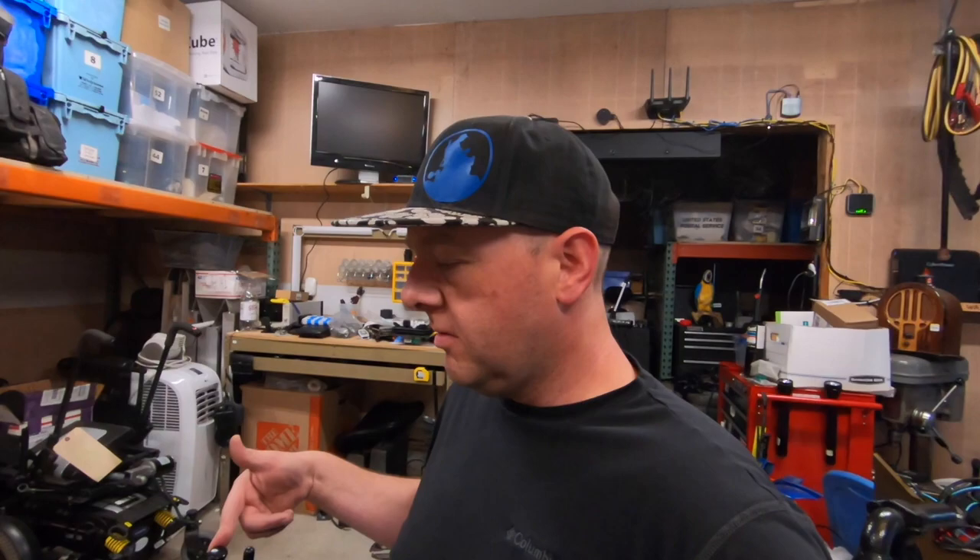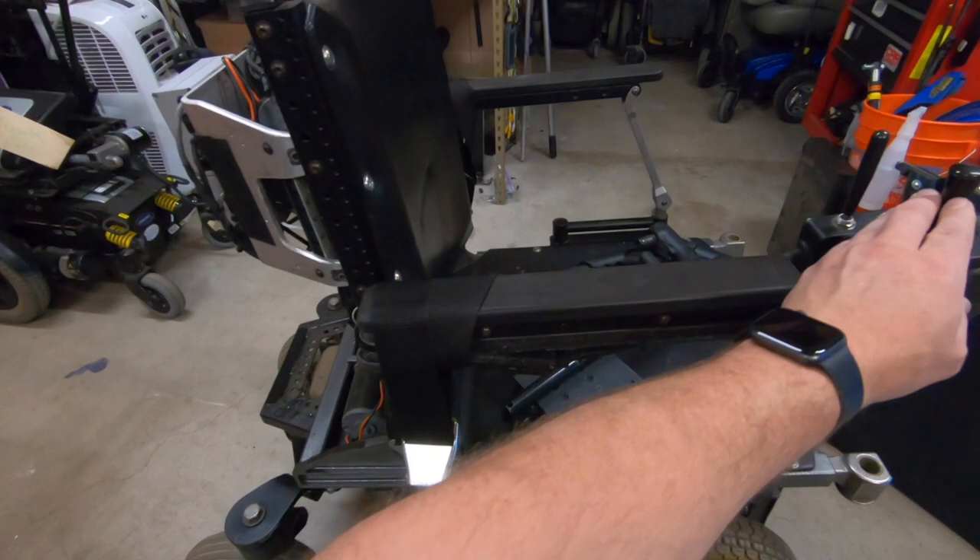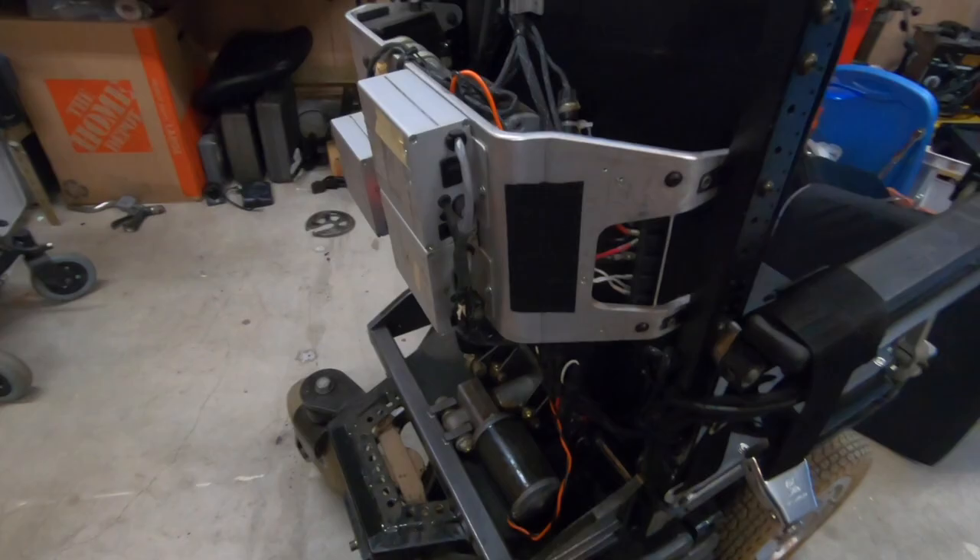The batteries on this are already going dead, so I'm going to hop into the other chair for now. I need to look at the belt drive — it's got a couple of cogged drive belts on this that engage with the drive pulleys, and I need to look at some of the bearings because I don't think that noise is good. The thing does have full rehab seating — it's got a tilt, recline, power legs, and it used to have some covers on the back of it.